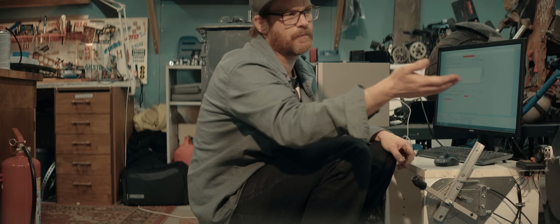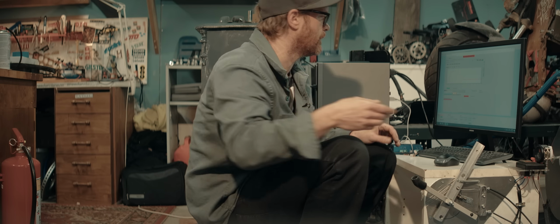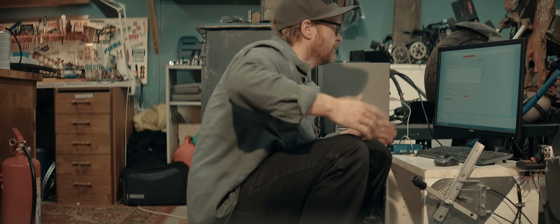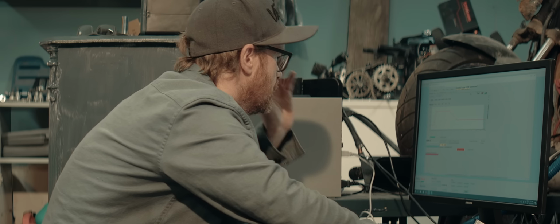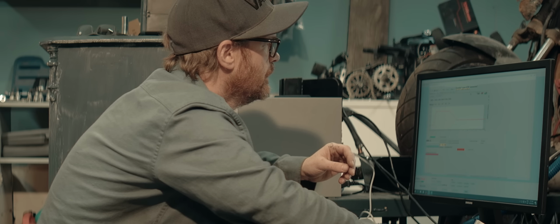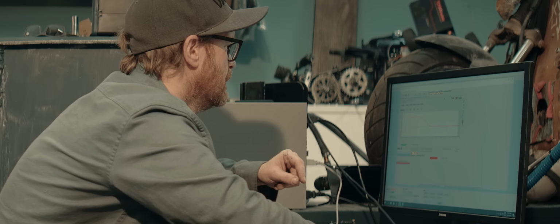Seems to be worse. We've probably moved that pressure peak too close to top dead center, maybe even before now. Let's bump it down to around 25 and see what happens. 25 degrees of ignition advance from 2,500 to a little bit over 9,000, then ramping down to 15 at 13,000. Let's see how it behaves.